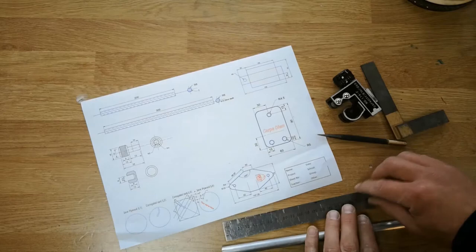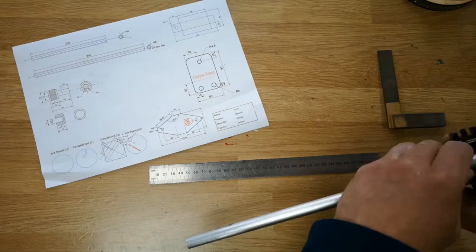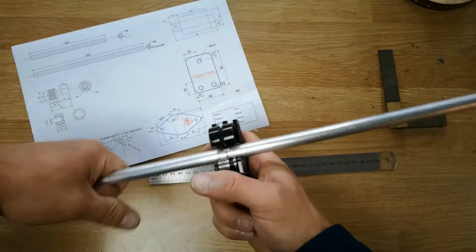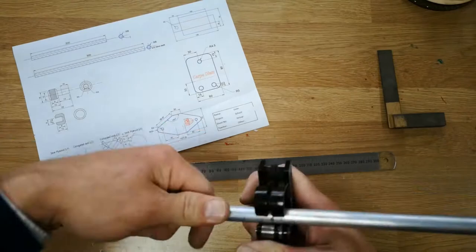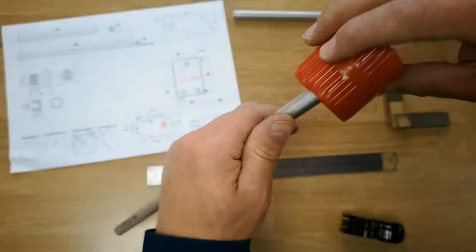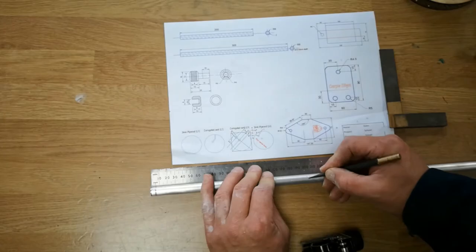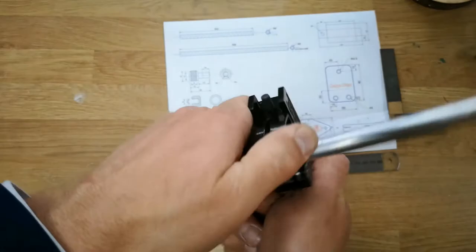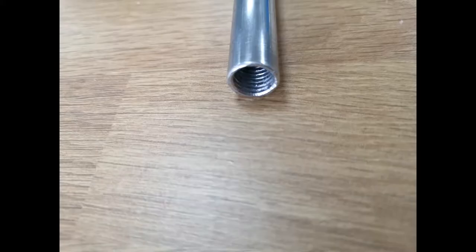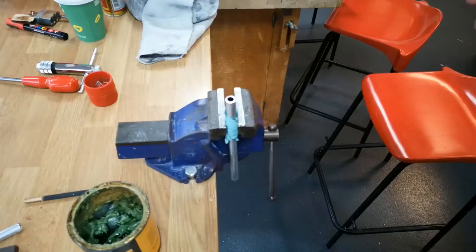Process number 7 is cutting the aluminium. You've got these two upstands here. The first one to cut is the 300mm top arm — get your engineer's ruler, engineer's scriber, and your pipe cutter. Spin it twice then tighten the black lever, spin twice, tighten, repeat about five times and the pipe should cut. It gives a much neater, more accurate finish than using a hacksaw. Then get the deburring tool to clean out any sharp edges or burr from inside and outside of the tube. Now cut the 200mm length as well.